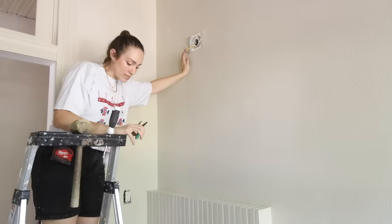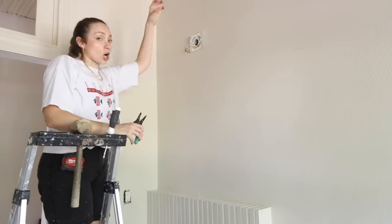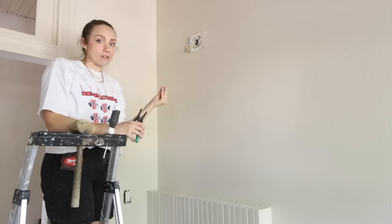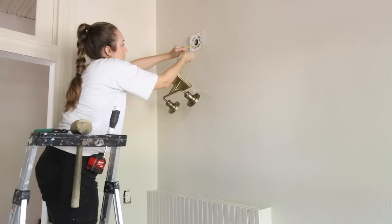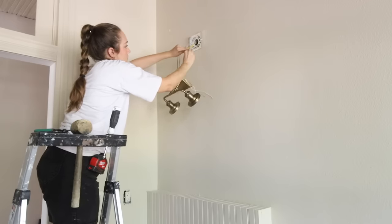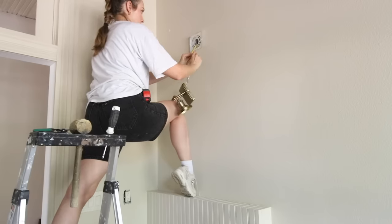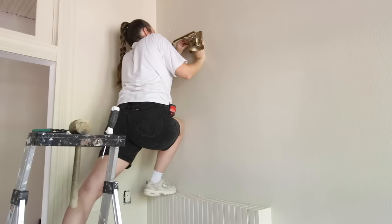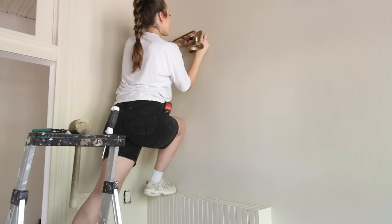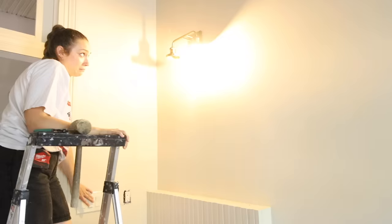Something that I would always mess up is that the wire has the copper and then there's the sleeve. So it's white and black and then the ground is just copper. What I would mess up on is I would strip away too much of the sleeve part, and when I shoved all of the wires back inside, they would touch and then I would trip the breaker. I must have done that so many times before I realized you don't want anything exposed. You don't want them to be able to touch. So I started stripping away less of the sleeve and it really, really worked.